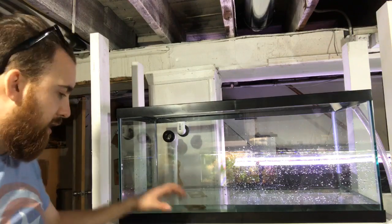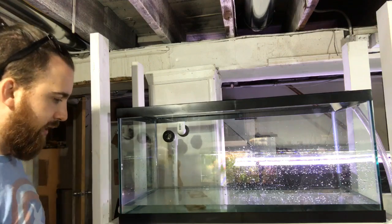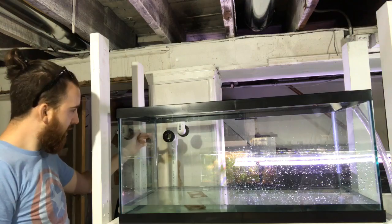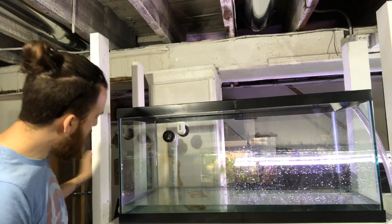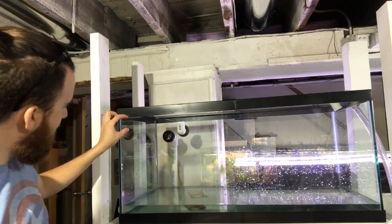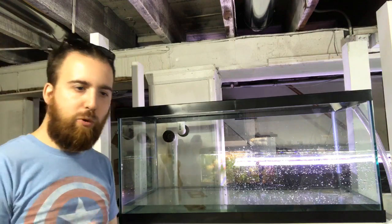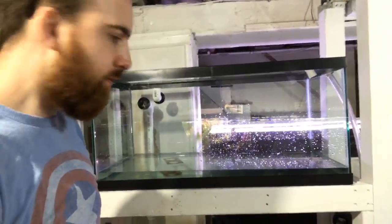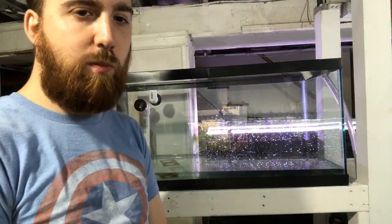And essentially, the bottom tank is not going to be all the way filled, because the way I'm going to fill it is it's going to be enough to keep this at a constant water line. So if this was ever to drain a little bit, it'd only drain maybe 2 or 3 gallons. So I'm going to leave this much space on the bottom tank, and that will allow it to break the siphon, and only the water will be able to pour down and not be enough to overflow it on the floor. So I don't think I need to put any other check valve systems or anything else in place. I think it should be fine.